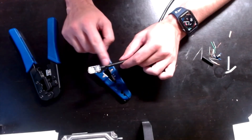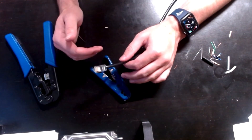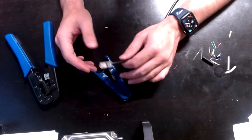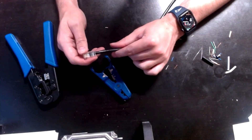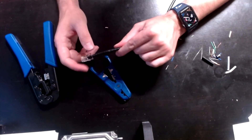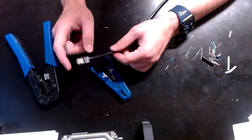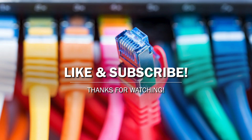Some people will use little strain relief jackets or boots right here. I prefer to use them for any type of office, warehouse, or shop type of work. When it comes to houses, I don't usually use them as often unless requested. But some people put the jackets on no matter what, and some people never do. I suggest the jackets for any shop, warehouse, or office setup; for homes it's personal preference. I hope that helps you out. If you have any questions, comments, or concerns, leave them down below. Thank you for watching and be sure to like and subscribe.